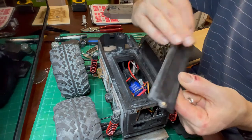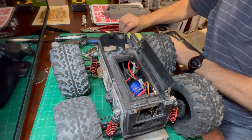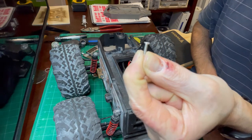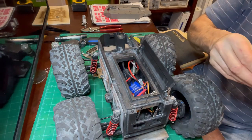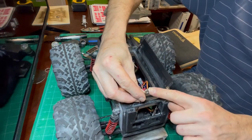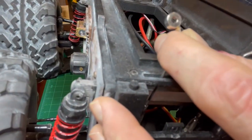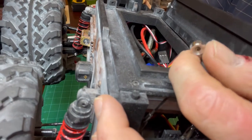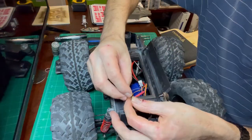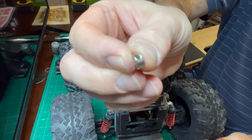These are M3 holes on both sides. It's a flush head screw and it's 10 millimeters. When you're preparing your wheel collar — the wheel collars come with both sides looking flat. Take a drill bit that's approximately 7 millimeters and countersink it so you can get the tapered screw in — it makes it look just a tiny bit better. The shaft is M3, so it's an M3 shaft, but it's also an M3 grub screw hole in these.